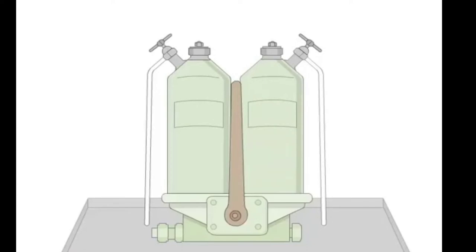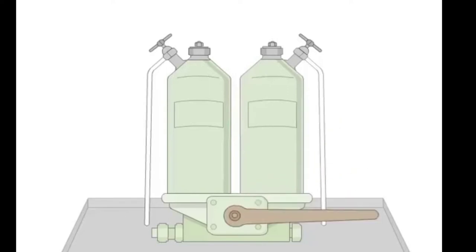If the filter elements are clogged, blow-off is not effective. When blow-off is not effective, we have to clean the filter element when it is not in operation. First, we use the lever to isolate one side of the filter and open the purge cock to ensure that the oil flows through the filter.